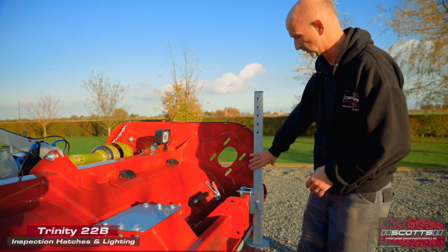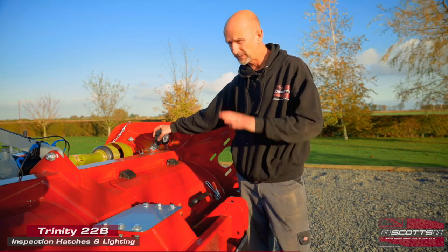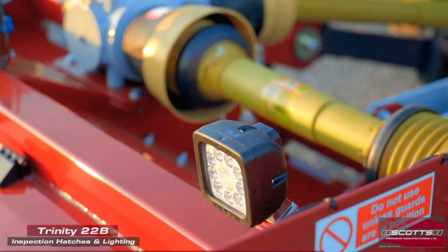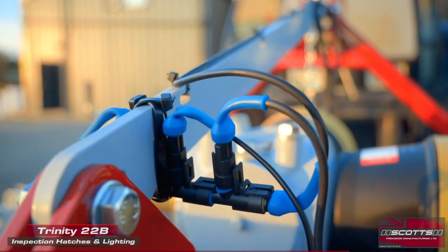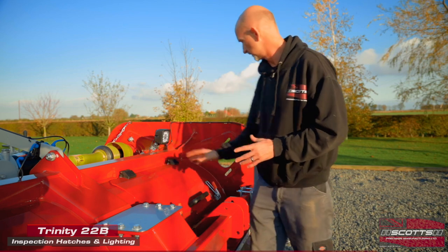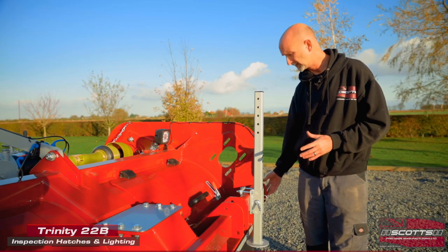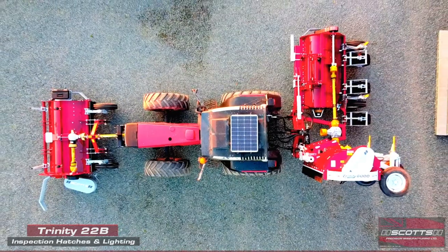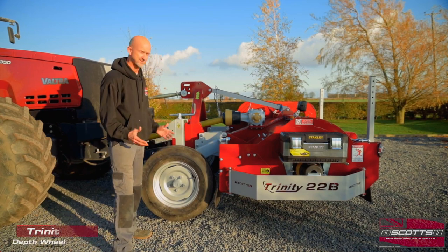A couple of stands — they do what they do. We now put LED lighting on these front toppers when front mounted. It's a nice plug and play system with proper waterproof connections, so every part of the loom is replaceable, super sealed, manufactured by a specialist company. That gives us some work lights when we need them. On the edge here we've got side repeaters. When you're pulling out of T-junctions in the evening, the first thing that pops out on the road is the topper, quite a long way from the tractor seat — so that just gives road users a bit of forewarning.